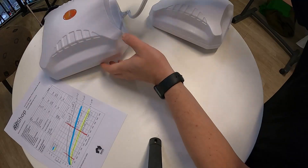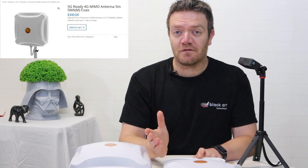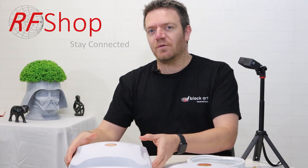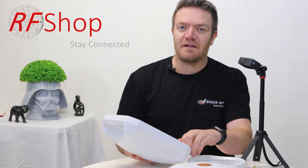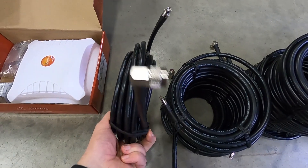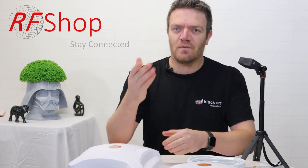Having various antenna models is useful here. The Expo 2, for example, has two versions on our website: one with a 5-meter cable, which is still handy especially for frequencies below 5G where losses are less severe, and a version with an N-type connector straight out of the antenna body. The N-type version opens up the world — you can attach any cable length needed for a specific project.